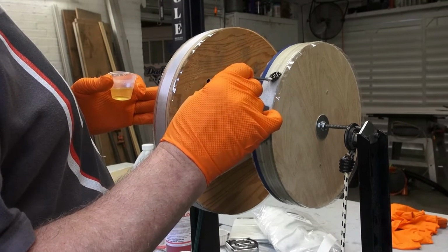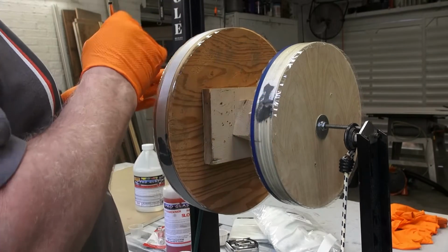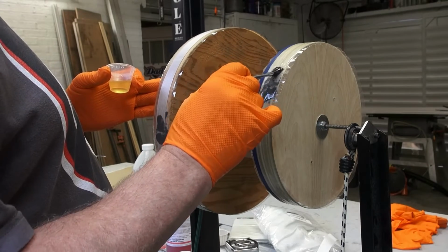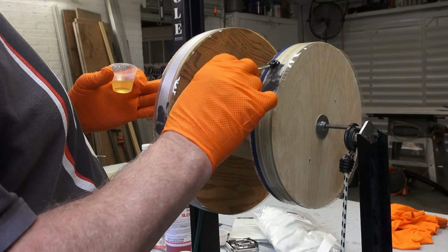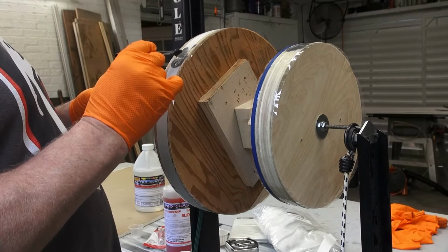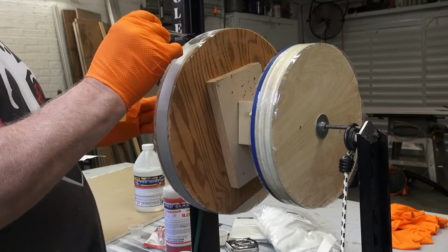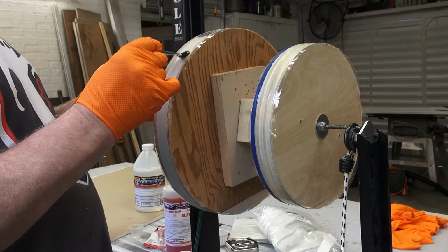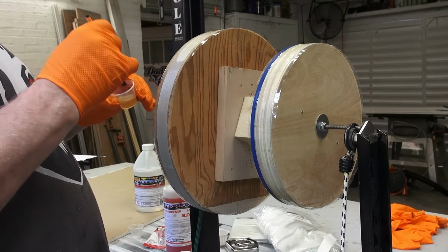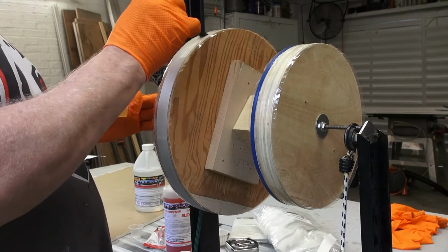So the way I figured the lengths of these fiberglass bands was basically pi times the diameter. And that got me in the ballpark, and I made it just a tad longer and trimmed it to length as I spun it on. Looking pretty good there. Start with this one here now. A bristle fell off. Won't be a problem, I don't believe.